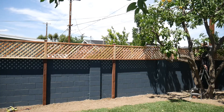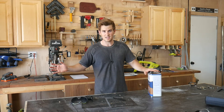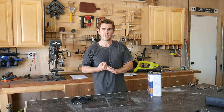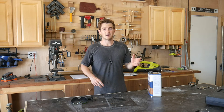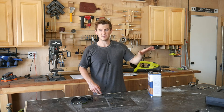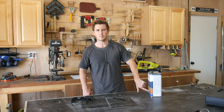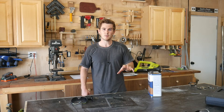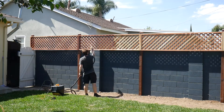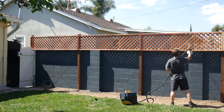We are on to the last portion of the build. The caps are in place and everything build-wise is good to go, so I'm just going to add a finish. I'm looking for something that will protect against UV rays and moisture. I'm in Southern California so tons of sunlight, not a lot of rain, but this will help protect it long term. One coat gives you four to six years of protection for a fence. This is Thompson Water Seal in autumn brown — I think that color will match the pressure treated posts. You can apply it with a brush, paint roller, or foam brush. I recently bought an HVLP sprayer system, so I'm going to use that because it'll go a lot quicker.